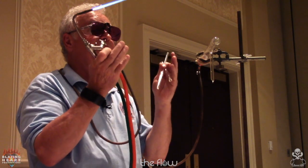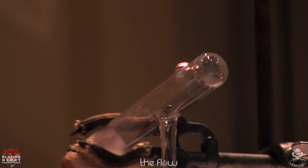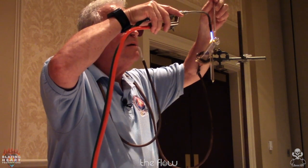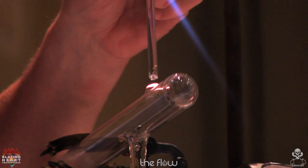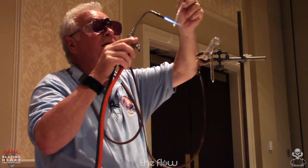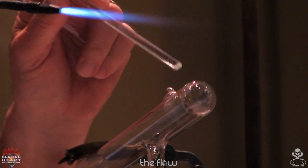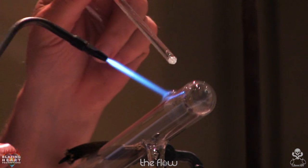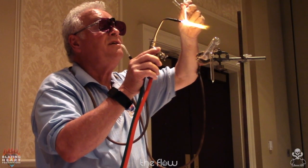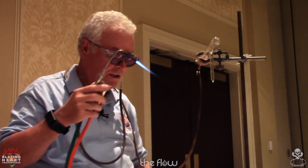Bring the glass up out of that tube. Come over after it cools, I'll come over and flatten the top. Reduce my flame. Come in here, pull that center out of there. Again, you want to get that last. I move the torch away so it's a little cooler flame. And I pull that little seed right out of there. That will be, if you're going to get a pinhole leak in a vacuum system or see a flaw in your seal, that's what's going to do it.